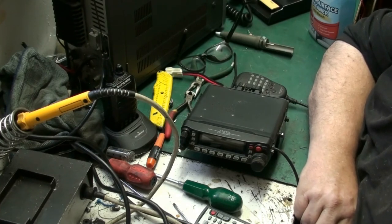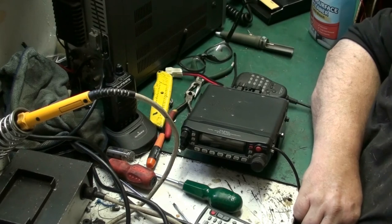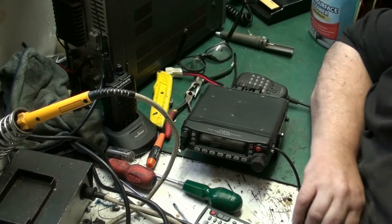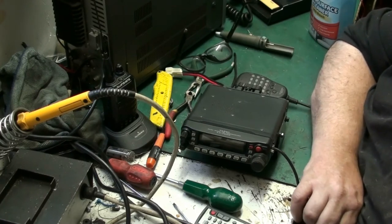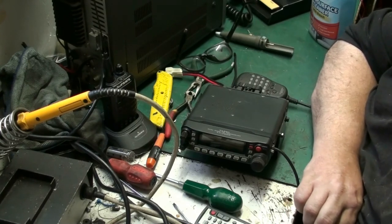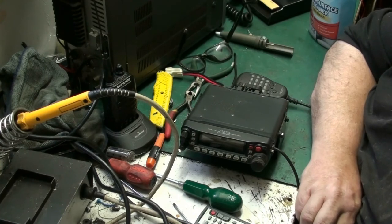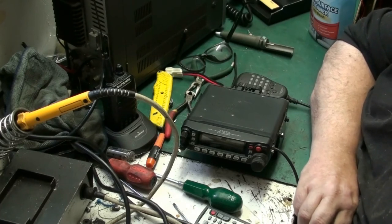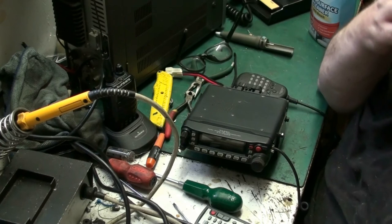That is actually from the feeder of the aerial. The radio can put out a bit more, because they do allow a bit more from your radio, since you'll lose some as it goes up your aerial. So I can put out about 12, maybe 14 watts at the radio, as long as it doesn't exceed 12 watts at the aerial, because you obviously get losses.